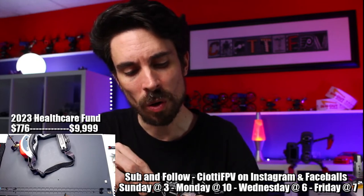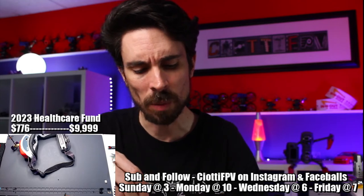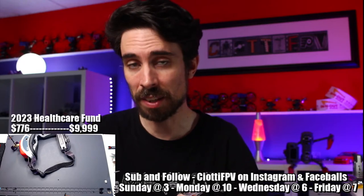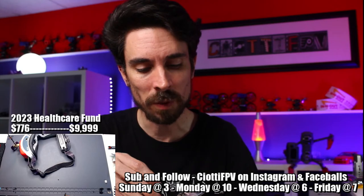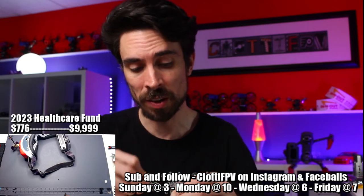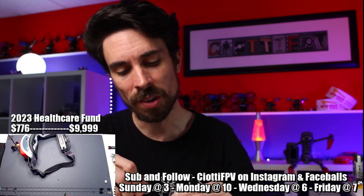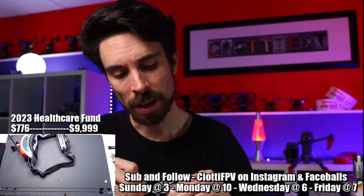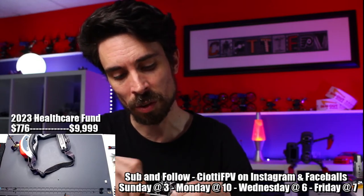And then for expo, you want to add a bunch. I use either 70 or 0.7. I forget what it is. You'll see it in there. That's a lot. I am a cinematic pilot first and foremost, though. So I want all of my camera moves to be very slow, very gentle, very smooth. You probably don't want 70. I would do maybe 40 or 30 to get yourself started, and that should get you out of the center of the stick travel quite a bit.